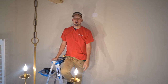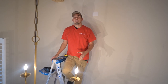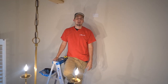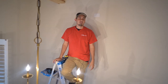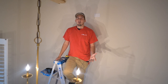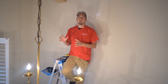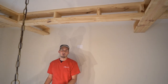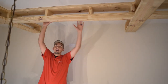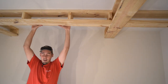Above this drywall there are ceiling joists — they're two-by-tens. This is screwed in with three-inch screws in multiple places across all these beams. So this is not going anywhere. The toggle bolts are not holding this up; those are just adjustment bolts so we can let it hang freely and then screw it up. This is not hanging on drywall — it's hanging on joist.